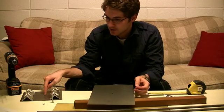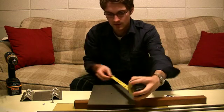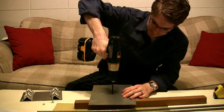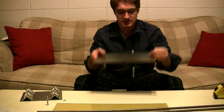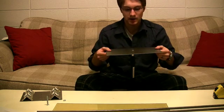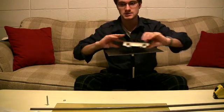Take the rest of the metal sheet used for the chassis and drill a hole in the very center — this is going to be the base for our guide rails, about 4 inches one way and 6 inches the other. Use a 7/32nd bit and go straight down into the metal, then a 1/4-inch bit to open up the hole to the right size. This allows you to attach the base with a nut straight to any stand — a light stand or any quick-release tripod — and this is where our guide rails will be attached.